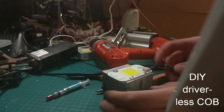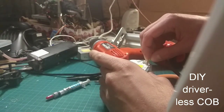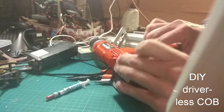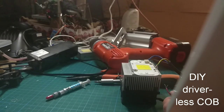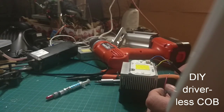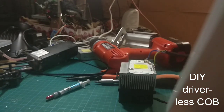What I'm going to do is probably just wire it to this metal thing here. You can do a much better job than I'm doing - I'm just kind of doing this in a hurry. The next step is to hook the fan up. The red is positive and the black is negative, to any kind of DC power supply from 5 volts up. You really should be actively cooling these things because otherwise the temperature goes well above 90 degrees, which is not what you want for any electronics. Just for demonstration purposes I'm not going to hook the fan up - I'm just going to quickly plug it in and out to show you how this works.